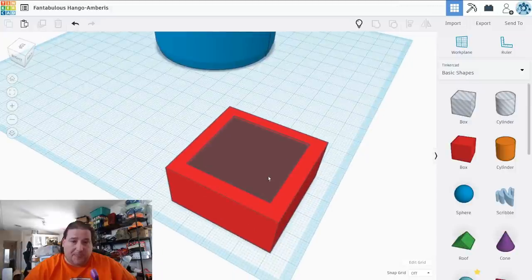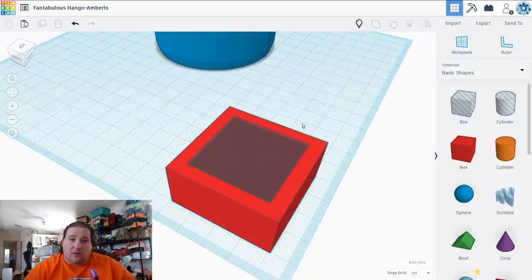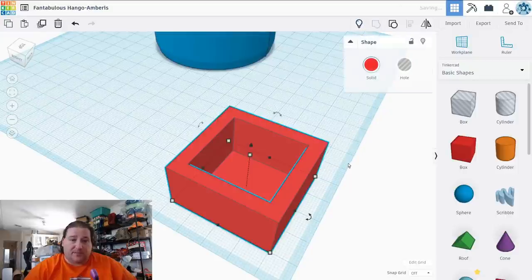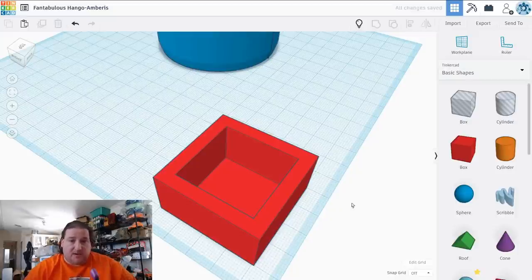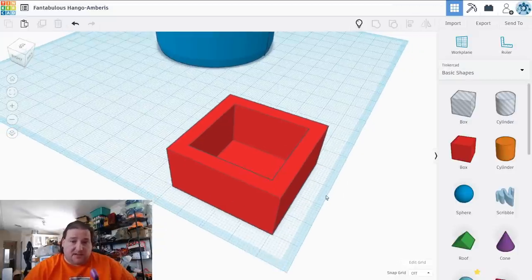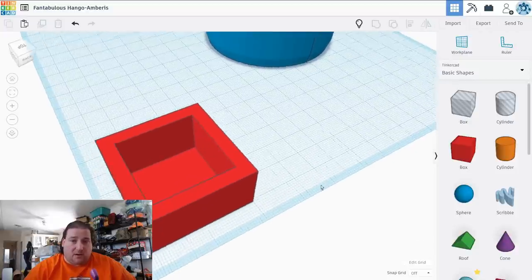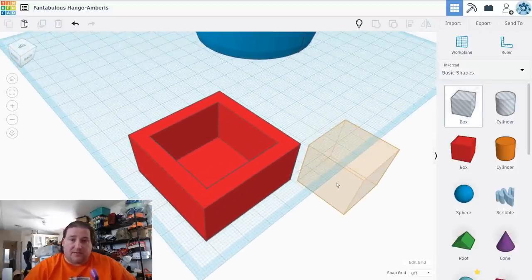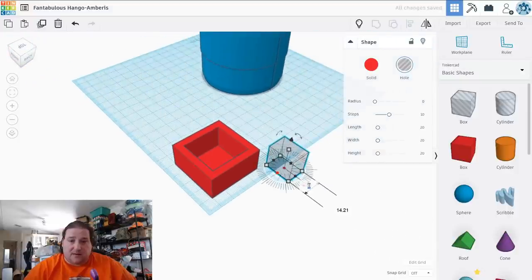All right. Make that a hole, join them together. So now what if we want to print this box in vase mode? Well, we need to bisect the box. Now, interestingly enough, this box has corners, so we can bisect it on the corners. So all we have to do is take another box, rotate it 45 degrees,